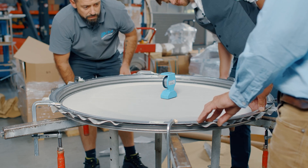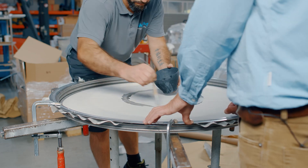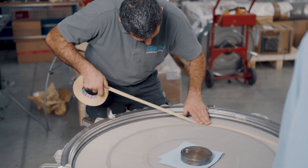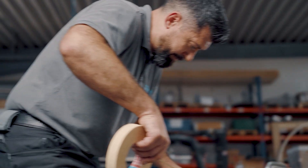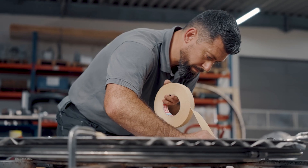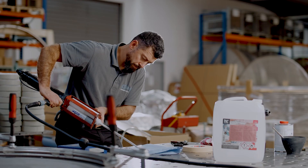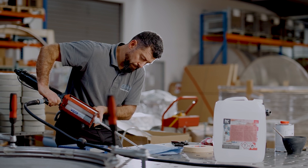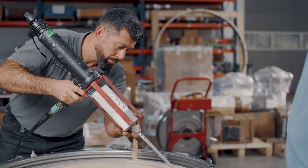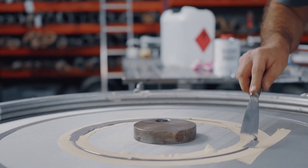When this is done, you can put some primer on the areas where you are going to put the glue on it. After having put the primer on these areas, you can put your stripes on the outer and inner ring to avoid that some glue is coming into the area of the mesh cloth where product is falling down. After this you can put some primer on it and then please use the two-component glue. You can use it with a pistol or also a manual pump — this is up to you. Then please put the glue on the already prepared areas and then you have to smoothen the glue to have a really nice surface.